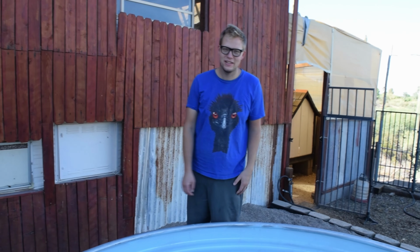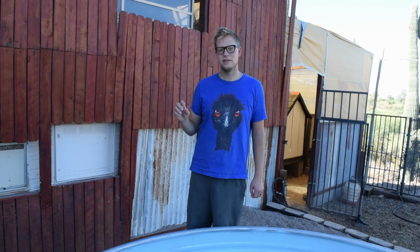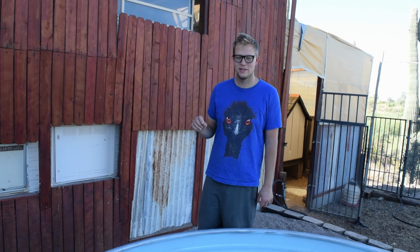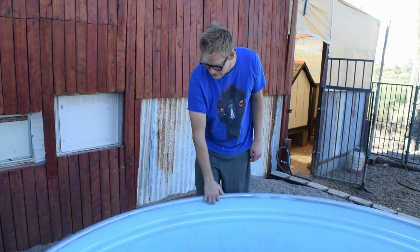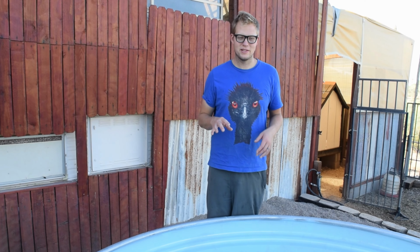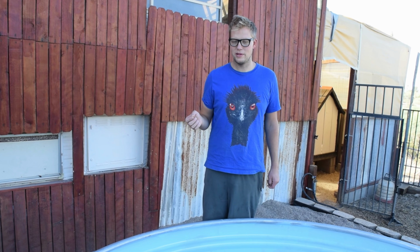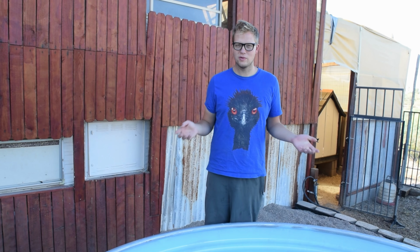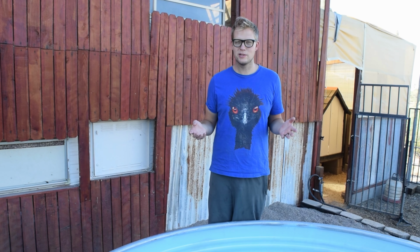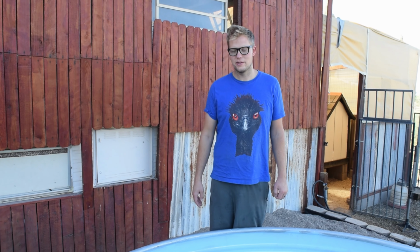So we painted the side of the pool yesterday. We wanted to get the whole thing done, but what happened is the paint started to solidify in the bottom of the bucket after like 10 minutes. So we scrambled to apply this, just the side application, and we had to throw out about half the paint because it was already solidified in the bottom of the bucket. And the manufacturer says it's not supposed to do that till about 1 hour after you combine the Part A, Part B. So the manufacturer's directions were wrong, or maybe, we were thinking because we live in the desert and we did it on like a 90 degree day, 90 degree evening, that it started to do that.